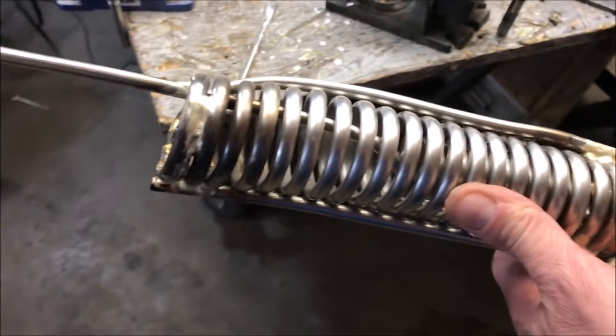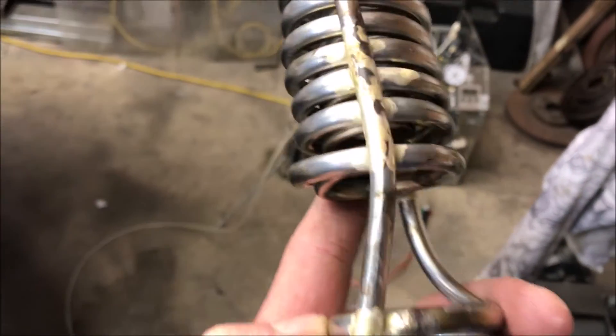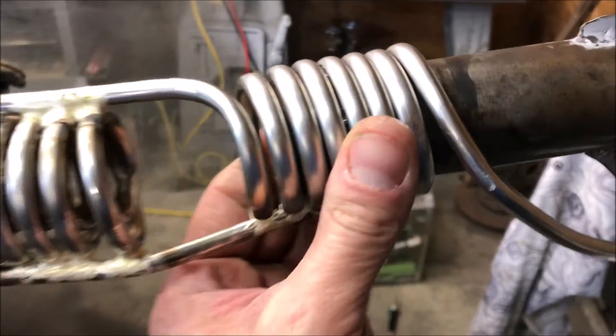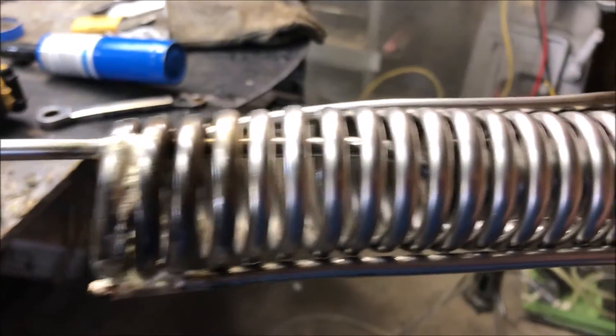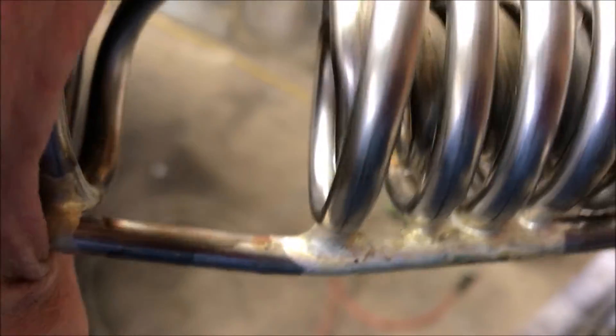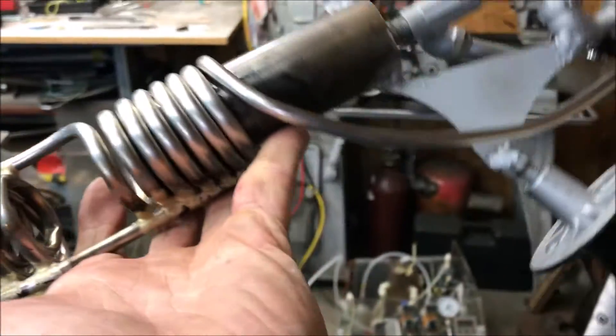This stainless steel is still stainless steel and it won't rust out over time. This is a monotube boiler that will at times have steam passing through it, or the coil may even get red hot in some spots — steam is very destructive to red hot metal. This outer coil is a little bit bigger than the other ones. This boiler has three parts: this is the preheat, this section here is the boiler itself, and down inside there you can see the superheat coil, which in this case I believe was a nine-turn. Just getting a quick look at this before I ship it off; we're getting ready to flare this end up.